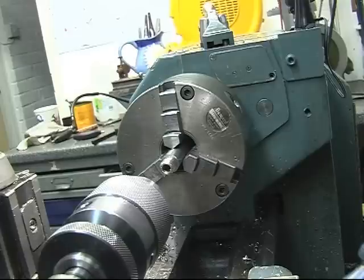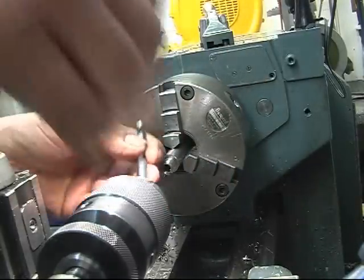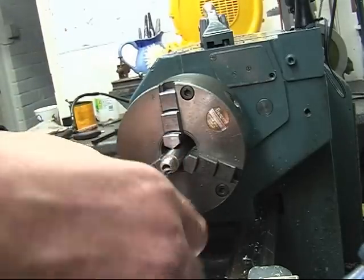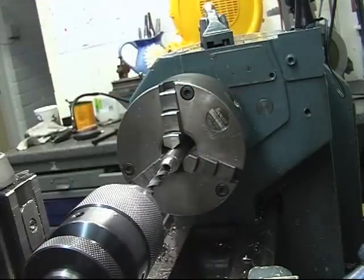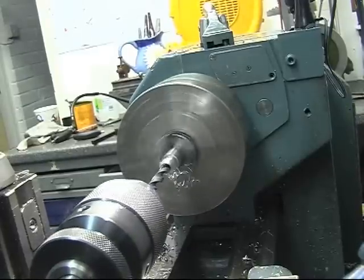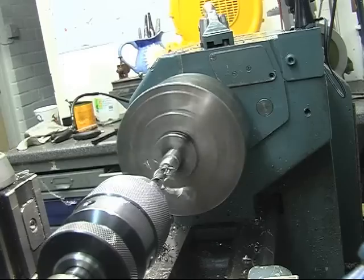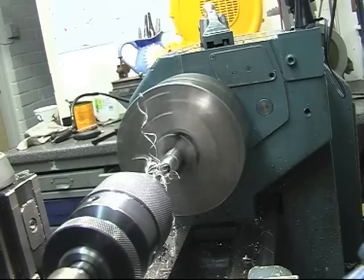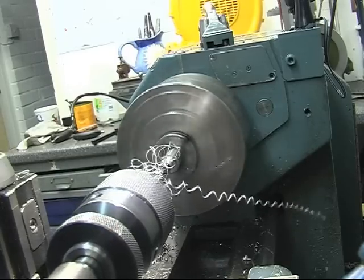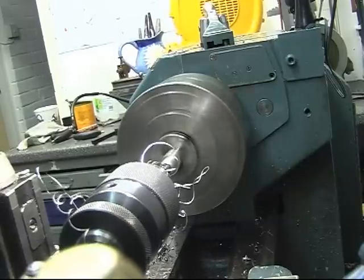Right, I've changed the position of the cam rack as I can. And I can get the arms in and I can clamber about without getting stuck in the friggin' thing. We'll go in with my 7.8mm drill. See how it's cutting, how it's putting the same size bit of swarf out each side. That's because the drill's sharpened properly. It's a brand new drill. It's the bottom of the hole there, you can feel it plainly.